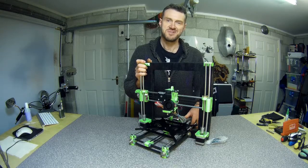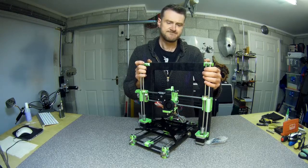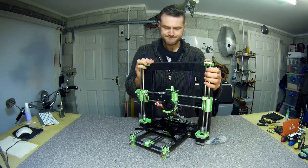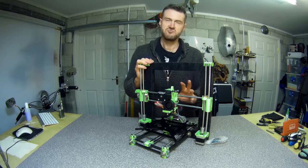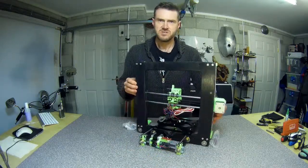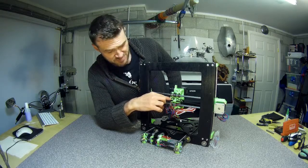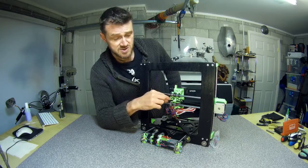It's one of those things you could do a lot quicker the second time. You're hesitant to drill too much in case you drill through the wrong thing, but essentially most of these 3D printed parts need drilling out. There are lots of nuts and in my case lots of cutting down hex cap bolts - you really need to get those 18mm bolts because cutting them down is a pain. Putting the belt on was also a little bit of a pain because the tolerances are just a bit too tight where the double layer of belt grips in, probably due to the 3D print.